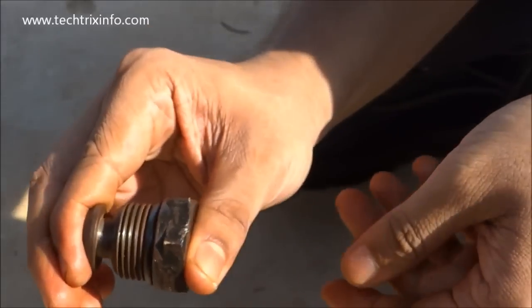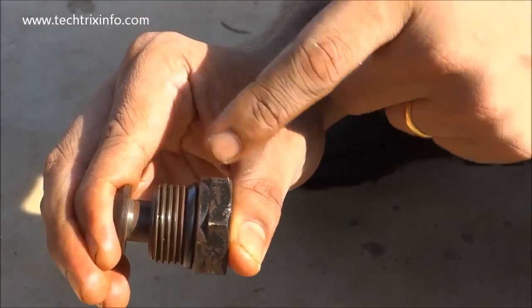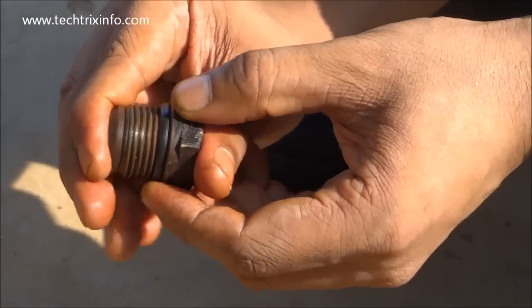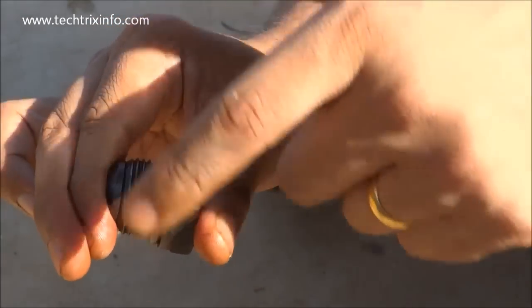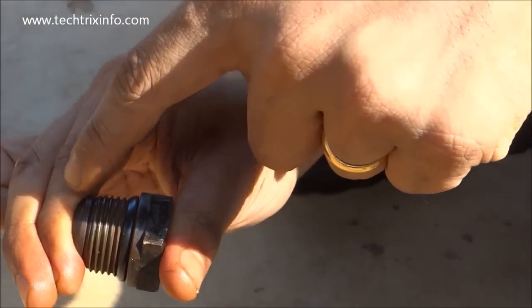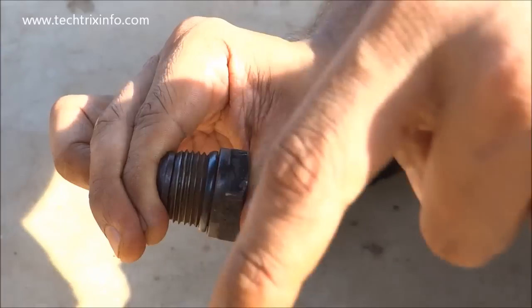See how simply it moves — I'm exerting a pressure over here which allows it to move, and the pressure is going back towards the poppet with the help of this spring which is in tension. A non-return valve allows flow in only one direction — that's why it's called a non-return valve. Here we have the pressure acting and it will vent the pressure back towards this direction.